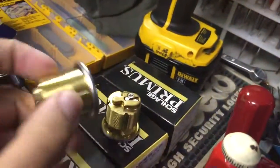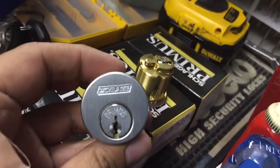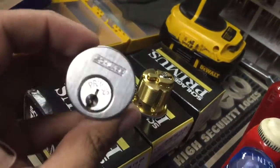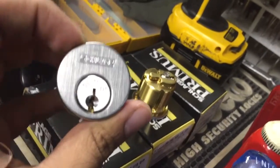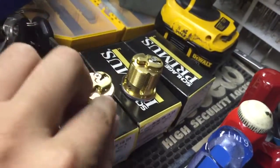These Primus cylinders came in from Lock Butcher Shop. Gonna try to find blanks and get these keyed up for them. They're zero-bitted but they do have all five finger pins in there. If I can't find blanks, at the very least I can make a pretty nice challenge lock out of them, because they're fully pinned on the side.